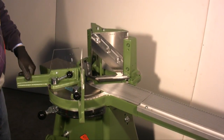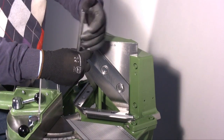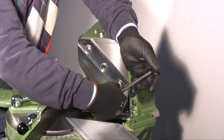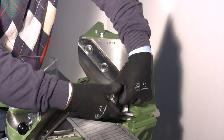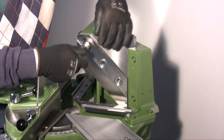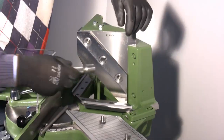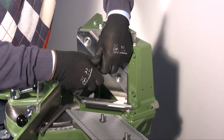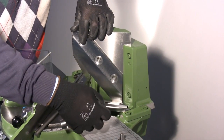At this point the blades are completely visible. I start by loosening the bolts. You can see that I'm wearing working gloves as the blades are extremely sharp. The blades need to be changed every 3-4 months depending on the volume of work of the framer. Lastly, I unscrew the center bolts whilst holding the blade, as otherwise it would fall.